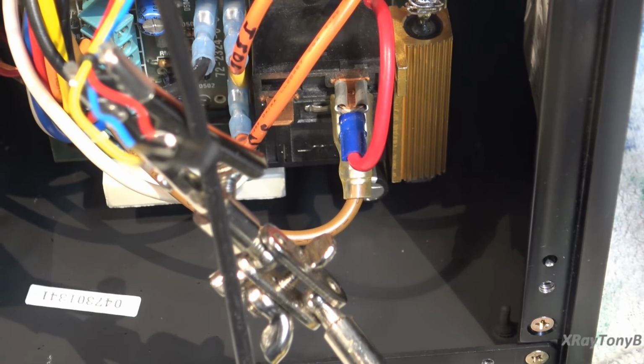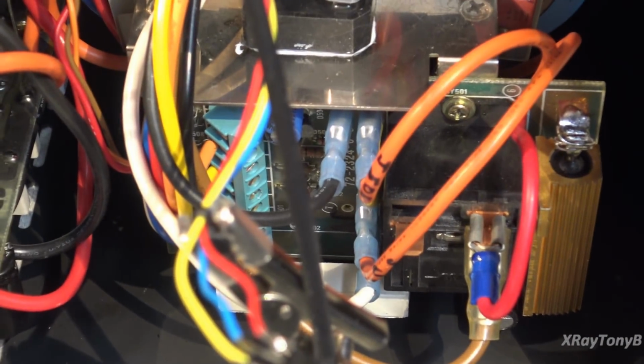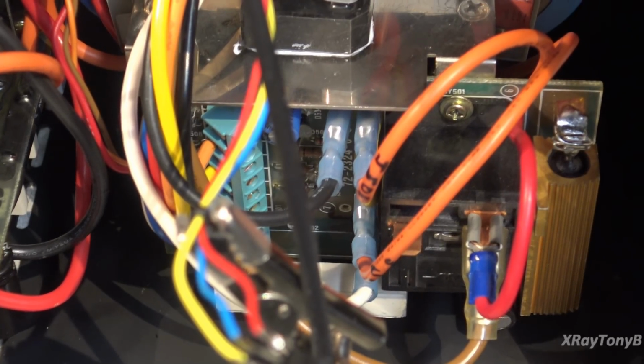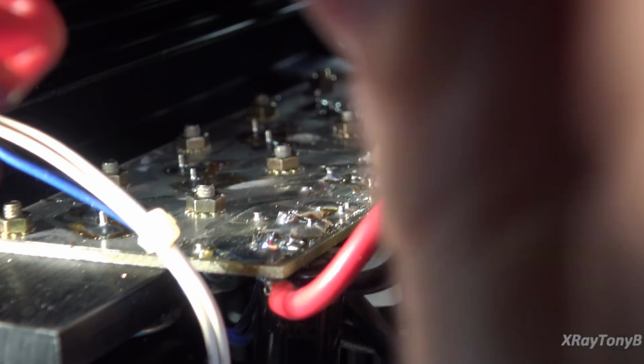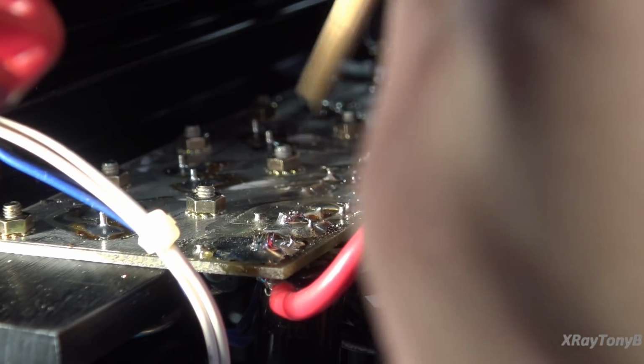So what we're going to do is, because it's so difficult to dig the transistor out of that hole, because they actually have it glued in there with thermal glue, both boards, both sides, the top and the bottom board, both of them have the hole drilled in it. So if you look inside here, you can see these are 3 brand new pads, never been soldered on. There's a hole in the heatsink and in the board.